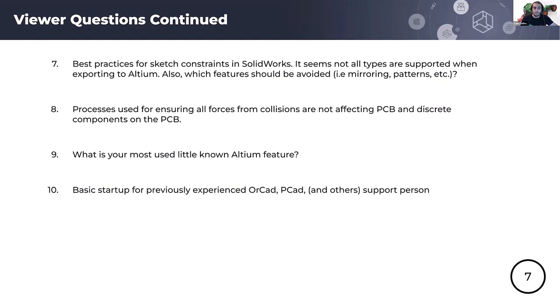Question eight regards shock mitigation — an issue we've experienced. If you isolate the board from the motor controller or the structure of the robot, it allows you to dampen input from collisions. We use rubber dampening methods within the robot structure for isolation. During component selection, we look carefully at large components — big capacitors can have internal failure modes under shock. Another common industry practice is staking components: epoxying components to the board is a really effective method for preventing them from coming off, particularly for larger, heavier components.